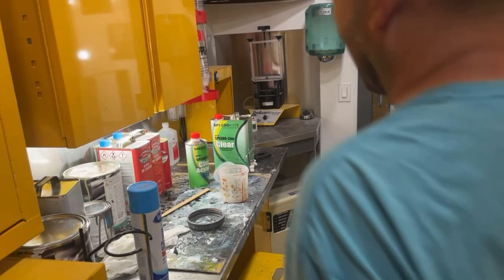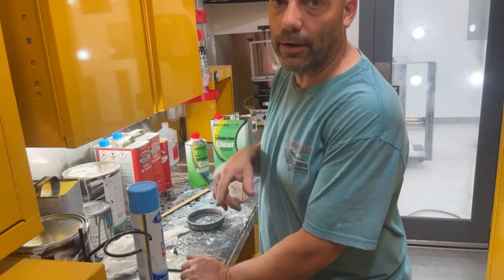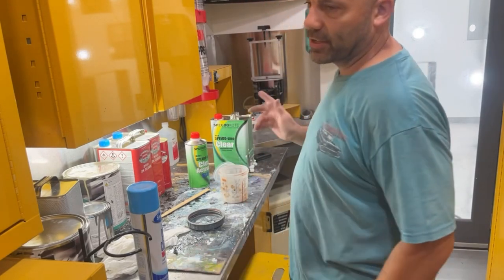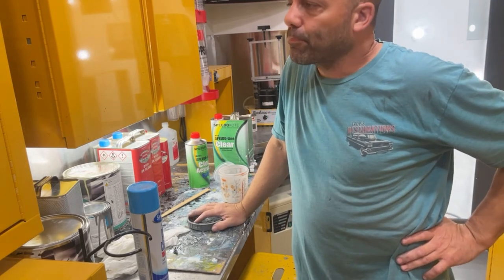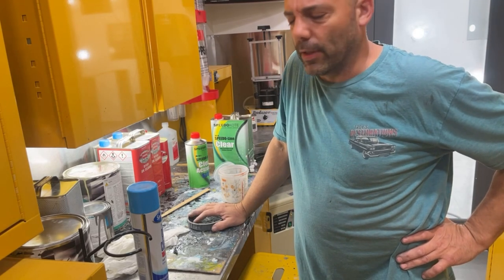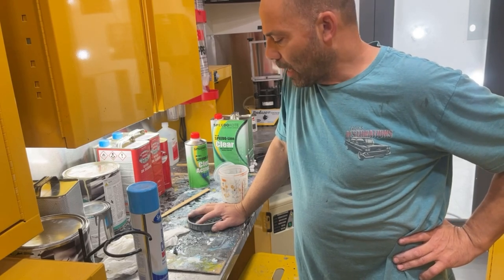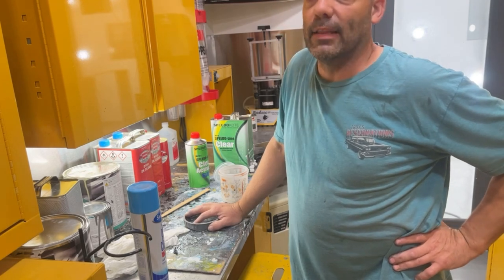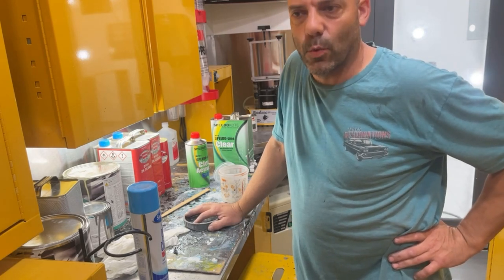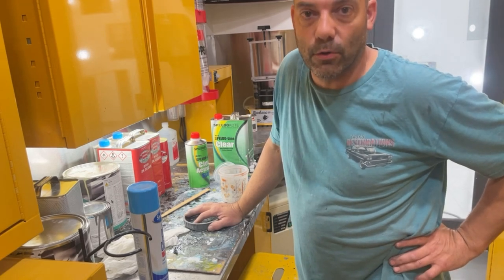Hey guys, welcome back. It's the next day. It's been about 12 hours since I sprayed the clear on those table bases, and I got a little bit of dirt and stuff in it, and it was a little orange peely. So I was going to wet sand and buff it this morning, but you know what? I thought, rather than wet sanding and buffing it, let's just sand it down with some 320, some red Scotch-Brite pads, and we'll do a flow coat of clear over top.